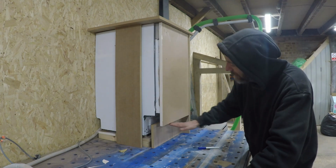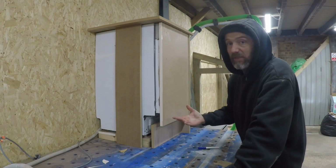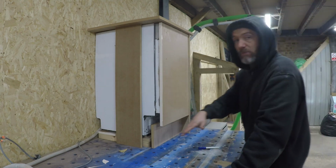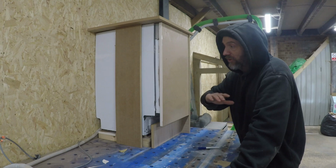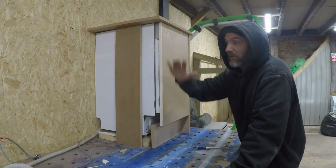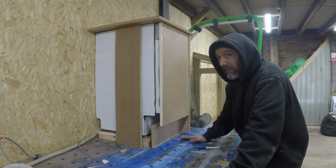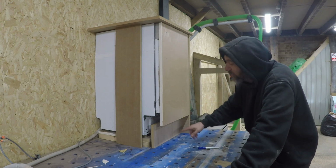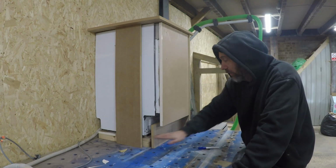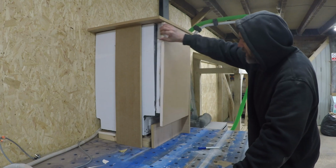But what it does mean is that when you stand back, you see a great big gap underneath. That doesn't always matter, because nine times out of ten you're looking at the dishwasher from above, but sometimes there'll be odd houses where you've got a long view up to the dishwasher, or you go up steps into the kitchen and you'll see this whopping great gap. It can be anything up to 20 mil, and it's always just a cutout around the dishwasher. It's never that the whole plinth is 20 mil low. Years ago, it always used to bug me.